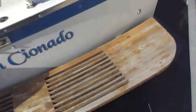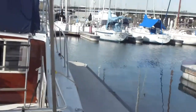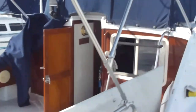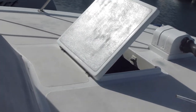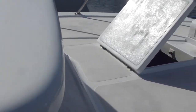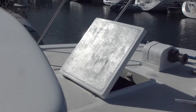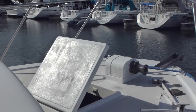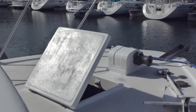And basically the ducks come here and take a crap on it. They sleep overnight on the back of the boat. And they really are messing it up, they already ate up the finish. There's the, now you can see it in the sun. He didn't do a pretty even job as far as the sand is concerned. I think he did it by hand, and the best way to do it is with a strainer. Put the sand in the strainer and shake it. Because when you sprinkle it like salt, it doesn't come out that even.